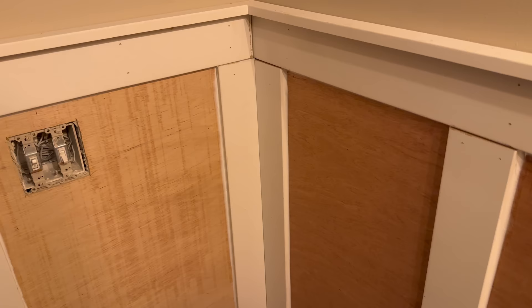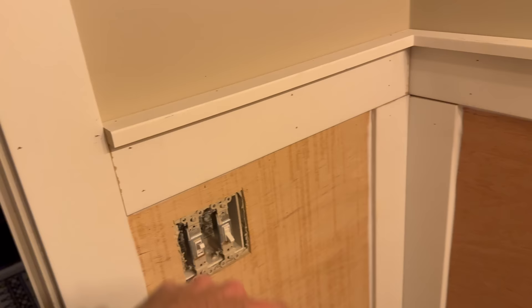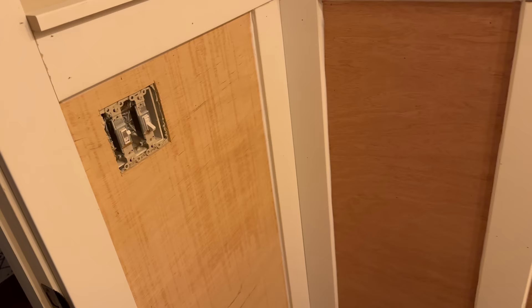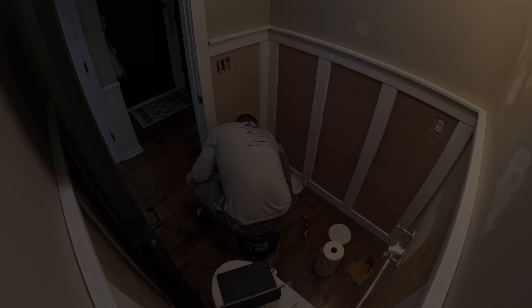Change of plans - I got a little bit done in this corner. What I'm doing is caulking around here so you can see a very clean-looking edge, especially once it's painted. As opposed to over here where I haven't done it yet - you can see there's a big gap. I'm also touching up the seams with some wood filler, filling the nail holes so I can sand them down and paint them. Didn't get as far as I wanted - almost never do - but it's 2am, my iPad's about to die, so I'm calling it for tonight.